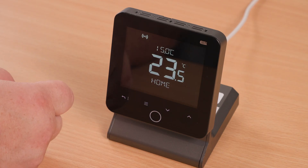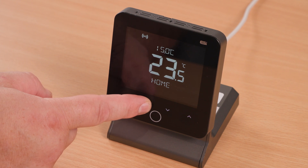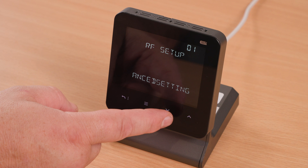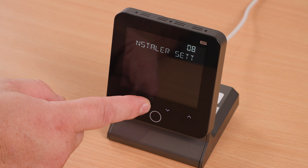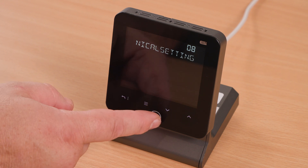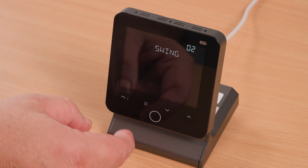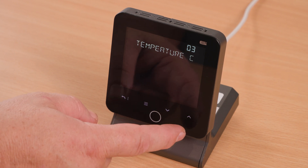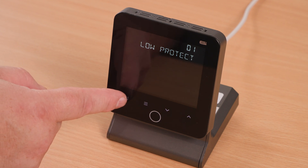Additional technical options. Tap the home button to wake up the thermostat, then hold the menu button until the screen shows 'RF Setup'. Use the down arrow to select 'Installer Settings', then hold the menu button until 'Installer Settings' changes to 'Technical Settings'. Press the home button, then use the up arrow and you'll see swing, temperature calibration, and load protect mode. When you've finished, use the return button to come out of the menu.